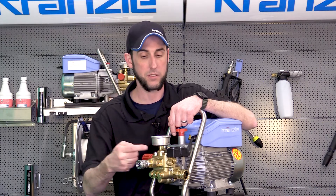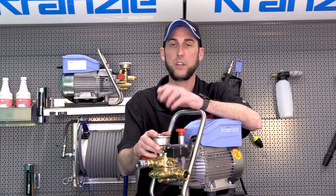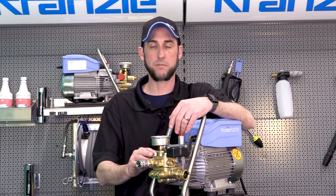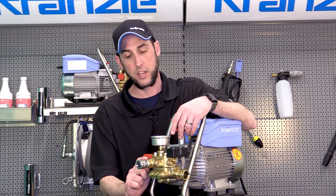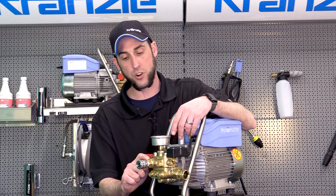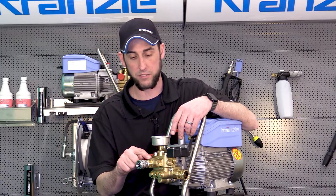Reassemble starting from the bottom: put in your o-rings first, followed by your check valves, then reinstall the caps. Come up top and do the same — o-rings first, then the three check valves, the two outer caps, then the center one, and reinstall the gauge. Force-feed water again to see if it now exits the pump.